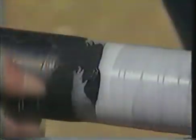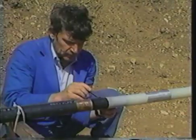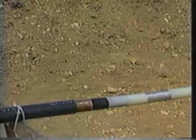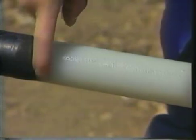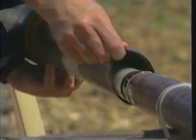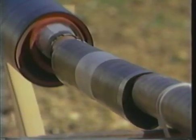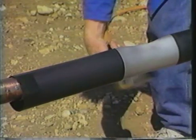A conductive paint is applied to improve screen preparation. Silicone grease enhances the surface of the cable insulation. At the screen ends and over the connector, the electrical field is controlled by a material with a stress-adjusting impedance characteristic. The material is installed as a heat shrinkable tubing, a technique that has been used successfully at medium voltages since the 1960s.